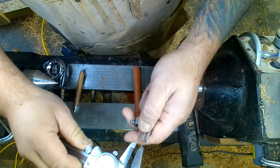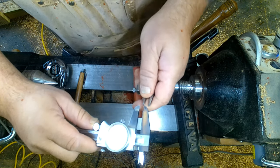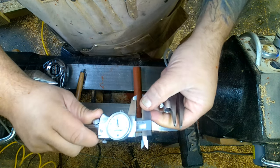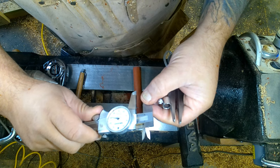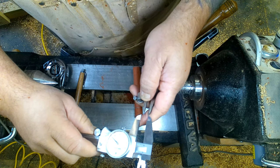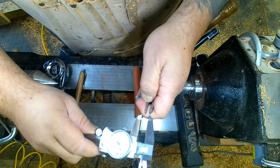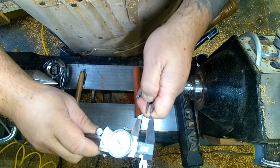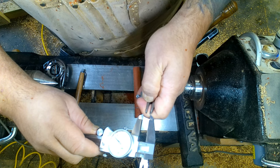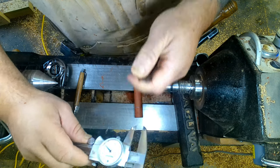So I can go .435 inches. The top and the bottom are the same diameter so I don't need to be too concerned about that. But that's the diameter I need to set half of — so .435 is going to be .2175. I believe that's the right measurement. I'm going to set this and we'll go back to .435 to verify — it should be double. It's a little bit off. It doesn't have to be super precise but it needs to be close.